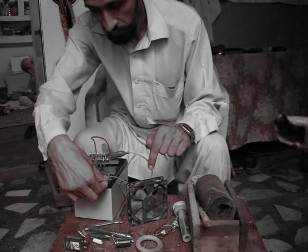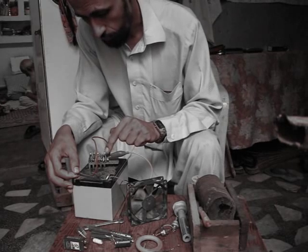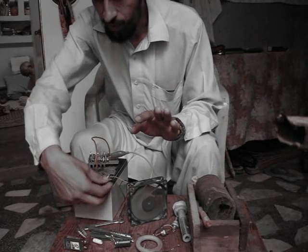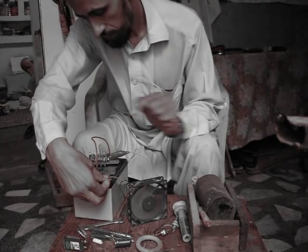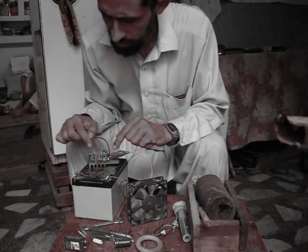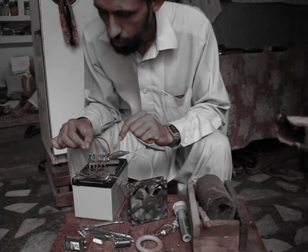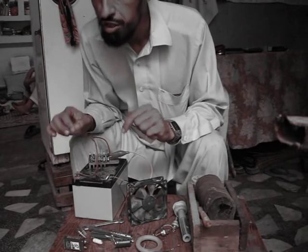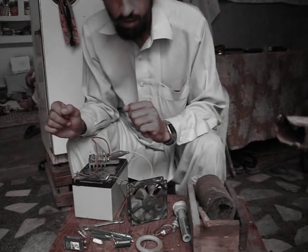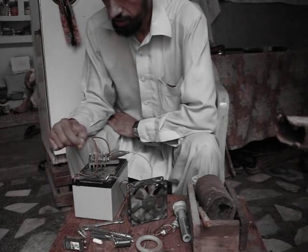The fan is being turned off. Once again, when I touch the positive of the battery and touch the gate of this single MOSFET — the fan is on. Once again, when I touch the negative and touch the gate — the fan is off. So that means this MOSFET is working. I have disengaged them all separately, so I have to test each and every MOSFET for failure. My video would be a bit lengthy if I keep checking each one here, so I have already checked all of these MOSFETs.